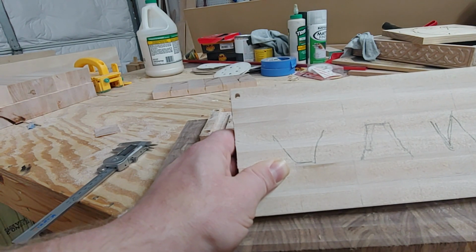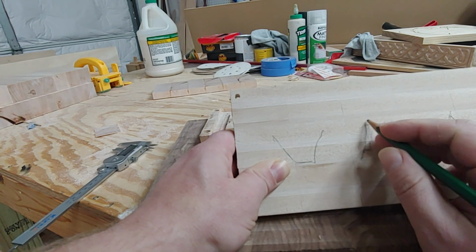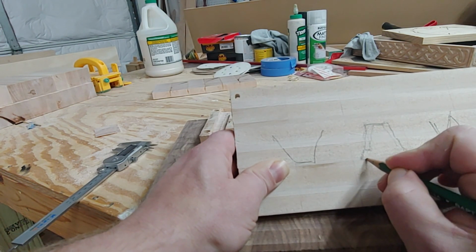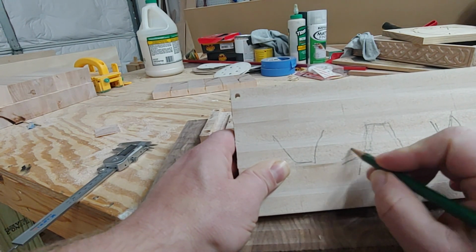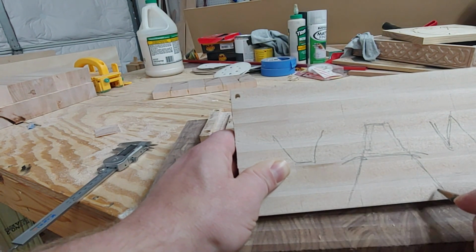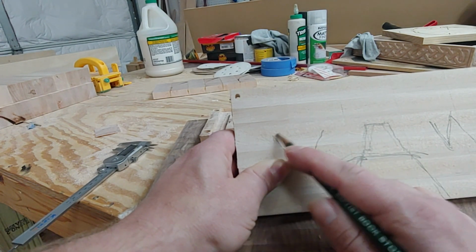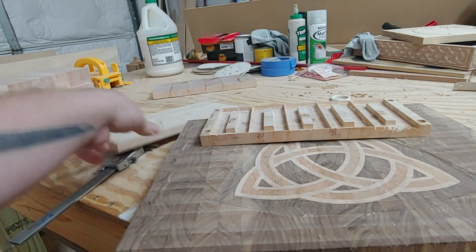This hopefully will make a little more sense when I'm talking about it with the computer going. But basically, if you're only changing, say you had a 20 start depth and then you have a 0.5 flat depth, this angle is going to stay the same because that's 0.20. You're only adding down here. Well, if your female piece gets too wide there, none of this is really going to matter. It's just going to create a bigger gap above the board, the bigger you make that number, and the harder it's going to be to get in. This number is going to stay the same, and it's going to fit in this the same way. That's my theory based on what I'm seeing here.